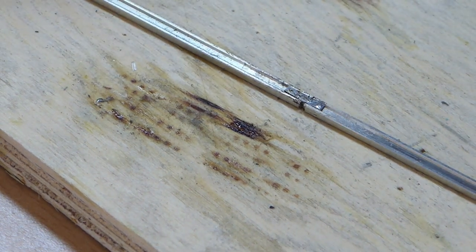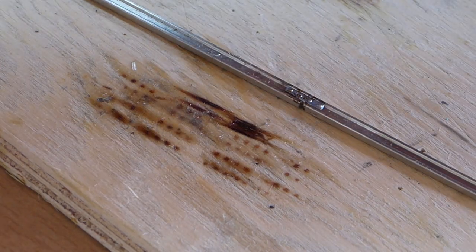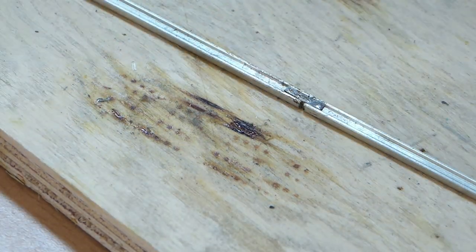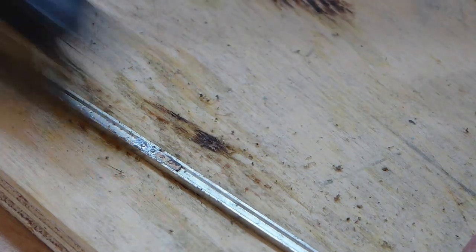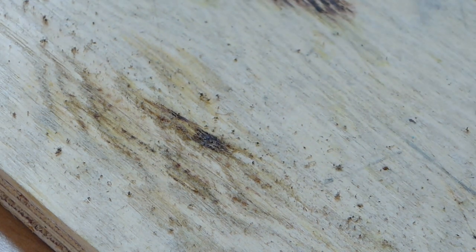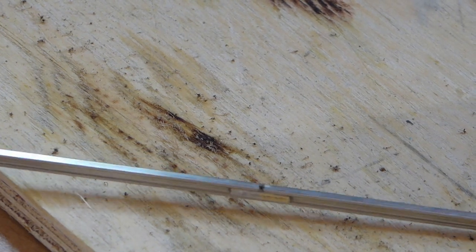Okay, have we soldered well or have we not? Unplug the soldering iron. Give it a wipe on the blade, on the little wet sponge or damp sponge, what you like. Get your wire brush, okay, and does it stay in position? Yes, it does. Does that one stay in position? Yes, it does. And so what we have there now is a nice, let's get in the camera, I'll bring it down here, simple. Yeah, okay, we've got a nice cosmetic rail joint.